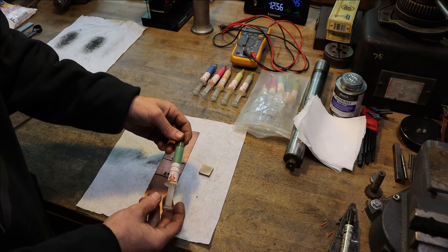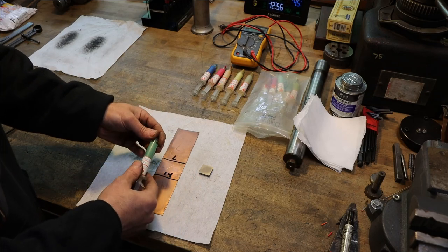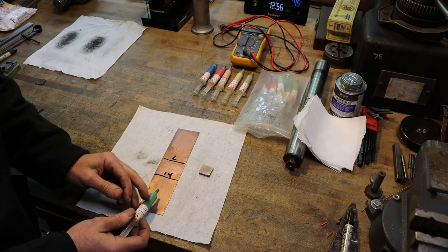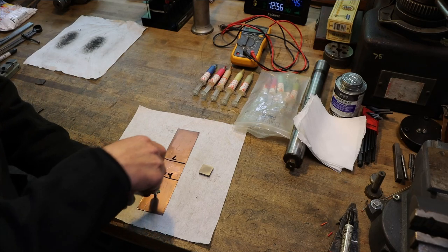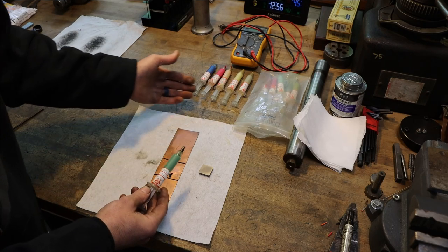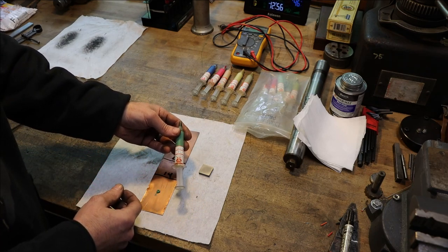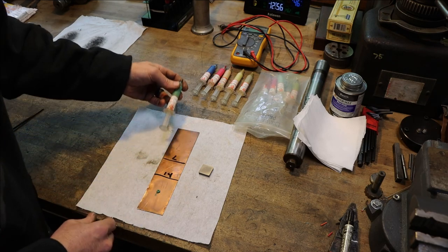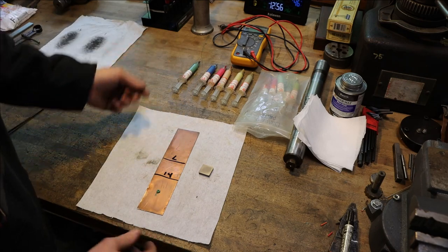That was quite some time ago, and I don't have a link, but you get the idea. Just search diamond paste. This is the cheap stuff, overseas, but it seems to be pretty good. What you gain with the higher quality pastes is just a finer separation of particle size. There may be a stray large chunk of diamond in this that may make your day bad when it comes to getting the surface finish you want. But the classification on this stuff is pretty good in my experience.